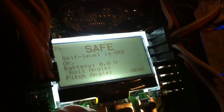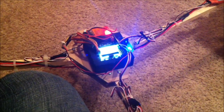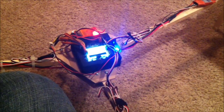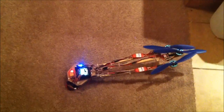Make sure you load the tricopter motor layout — that's probably the very first thing you'll need to do. Go down to 'load motor layout' and pick tricopter. All up, the cost just breaks $100 for the motors, speed controllers, and KK2 board, assuming you have a battery, transmitter, and receiver.